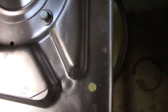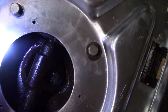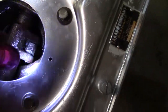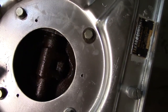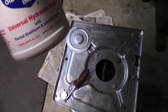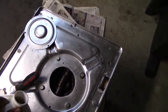Go over to the side, take this plate off, and right down in here — let the hydraulic fluid go. You can't really see down in there, but I can see it from this angle, and there's no hydraulic fluid in it. What I got here is some Lucas — it's basically a universal hydraulic fluid I'm going to use. I'm just going to pour it right down in here.